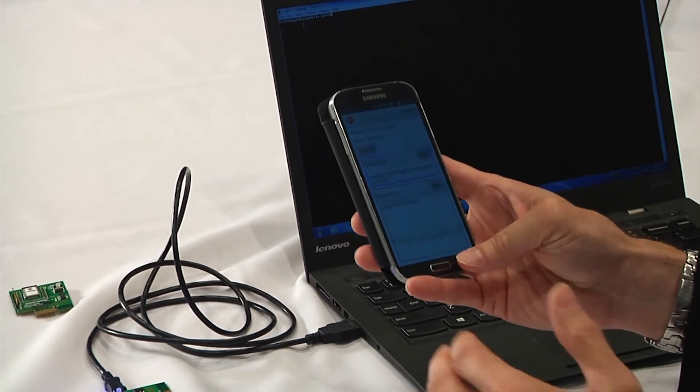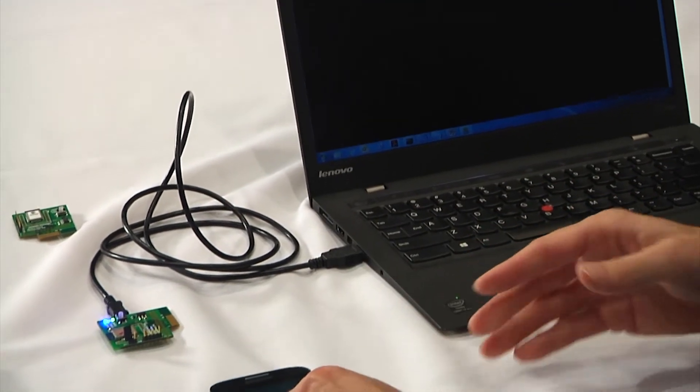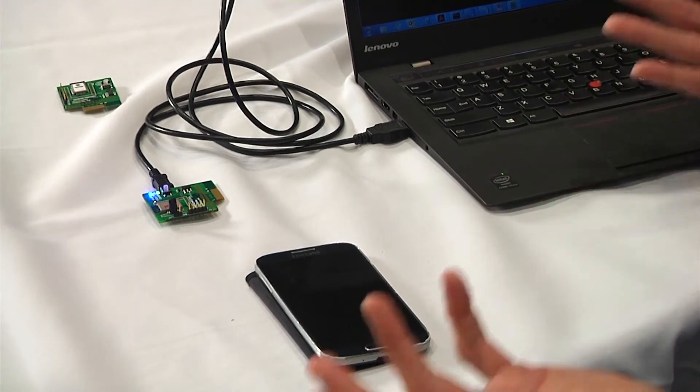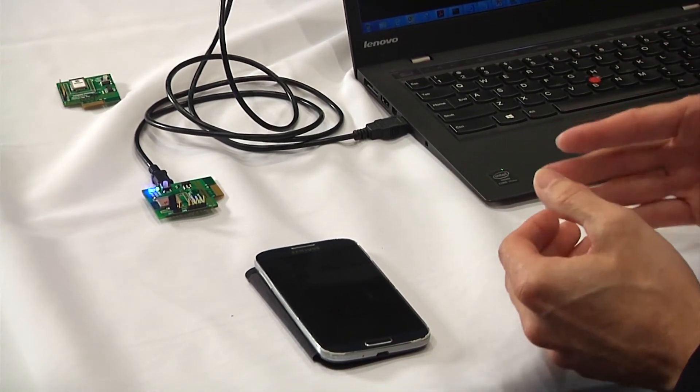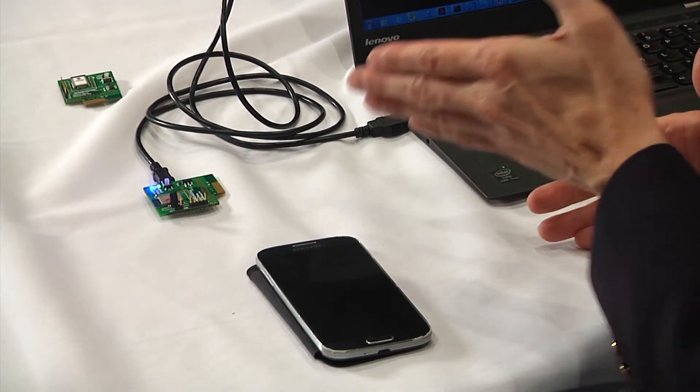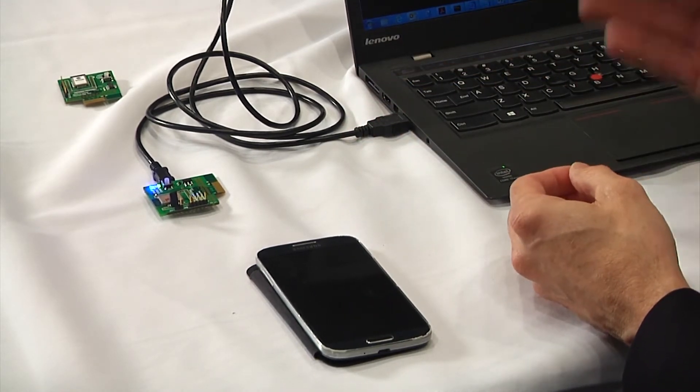What this does is allow developers to go beyond just the Bluetooth SIG profiles — they can send data over a UART like they've always sent data over a UART. Once they enter this command mode, the ASCII command set enables MLDP and data just transmits seamlessly. Thanks very much. Thank you.